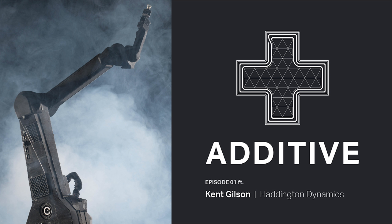Two of the most exciting things about your robot are your encoders and also that you guys are 3D printing cycloidal drives, which I had never heard of before. Here's a version of a cycloidal drive we built — it's a two stage. This is actually built as a single unit. We use the features of pausing the layer to be able to go in and insert bearings and shafts into the print. We even have a stage where we print the cams out — which are heavy carbon fiber laden — and then halfway through the print, we scrape those off the bed and place them inside of the other part being built. This was actually printed in a single piece, pulled off the print bed, plugged into the motor, and it runs.